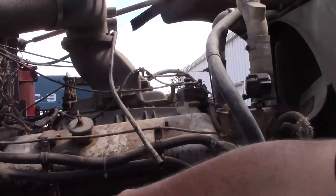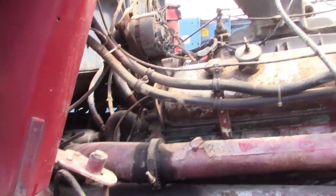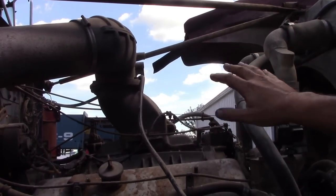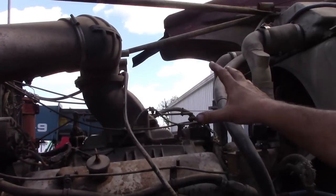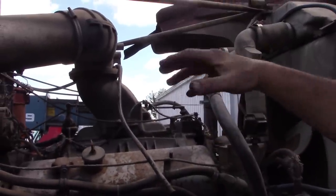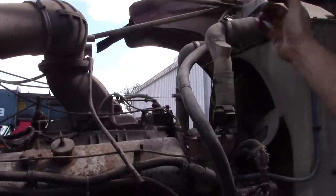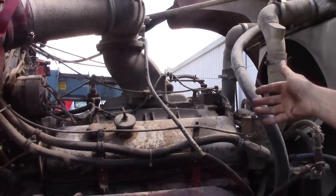So, you know, we already got indications we got some oil leak around the exhaust. So we want to make sure we're prepared, so if it starts to run away, I can put something over that intake and suffocate it so it can't get any air, and then it'll shut down before it grenades. Because if it goes to run on engine oil or whatever else that's flammable that it could suck in there, there's no way to regulate the RPMs. It'll just go as fast as it can, because diesels are fuel regulated, not air regulated.